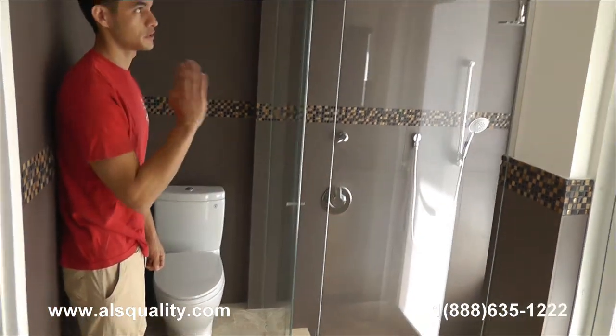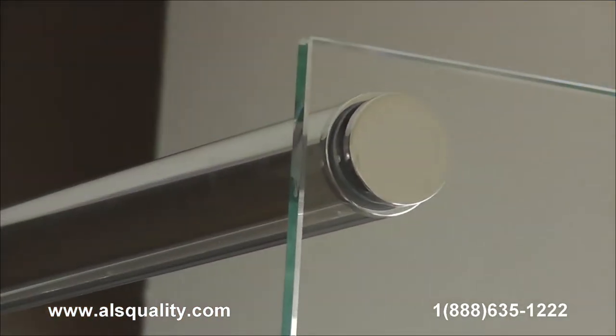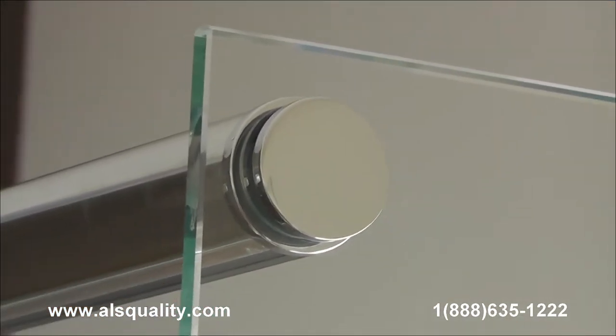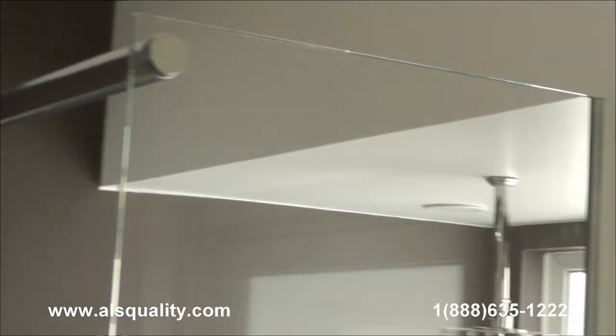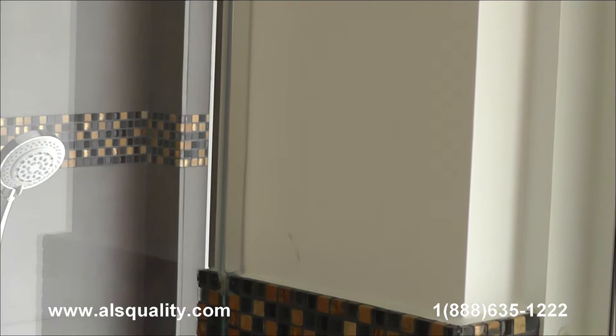On this side there is the return panel. It has on the top an end cap that receives the upper track for the sliding. On the other side of the panel, they didn't have any tile at all on the wall — just drywall — so we added a U-channel that matches the chrome finish of the hydroslide hardware. Clear silicone fills the small gaps and helps hold the glass.